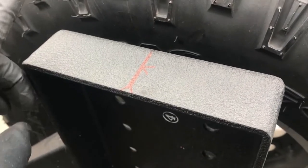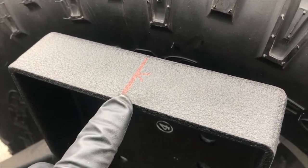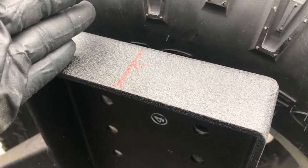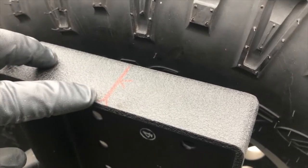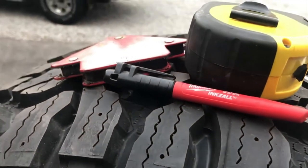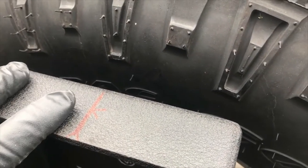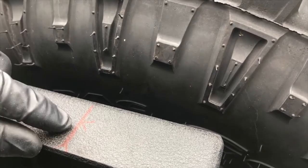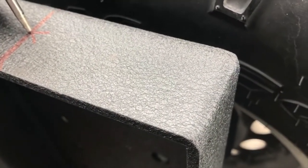The top mast of the tire carrier is about seven inches across, so I went three and a half and marked it. You never want to just do a dash with your markings — always do a V so you know exactly where the mark is supposed to be. I used a magnetic square, lined it up, drew a line halfway across for the middle line, and it's about two inches this way, so right in the middle is the one-inch mark.